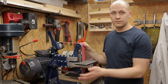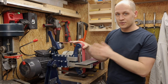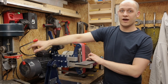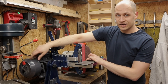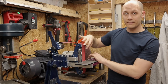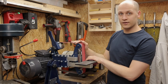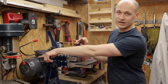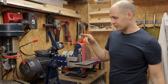That's for steel — you could go faster, but it's a good range. As I've shown with this belt and some metal, it really eats it away and the motor is super powerful so I have not managed to stop it yet. As a guideline they say you should go one horsepower for every inch of belt width. My belt is two inch and the motor is three horsepower, so that's actually one horsepower over spec, but I would definitely recommend it. It's not so much more expensive and it's a beast, so I'm really happy with that.